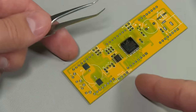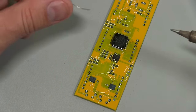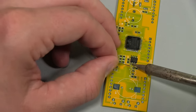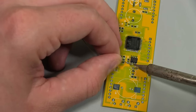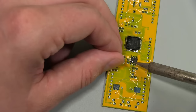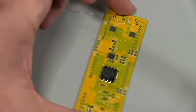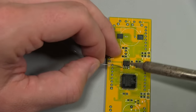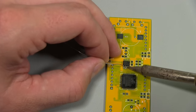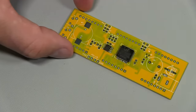And there's no need to drag solder this. The pin pitch is so big on this that I can literally just solder it like a normal part. I'm just taking a little tiny bit of solder off with each little brush, and that puts the pin down there. Go along on this side. These aren't perfectly aligned, but it's no worries. Just make sure we don't bridge it like that, and we're good. That's it, done. So we'll keep moving on.